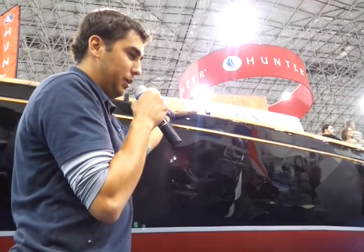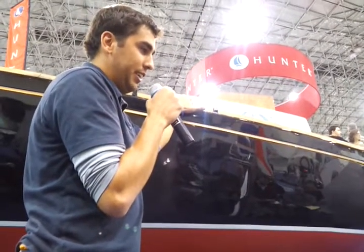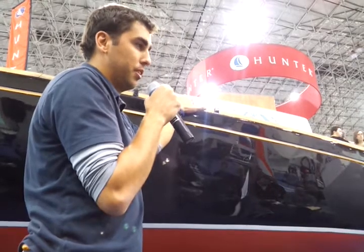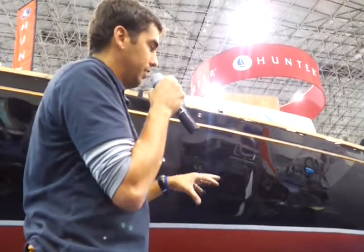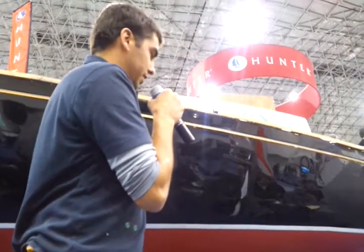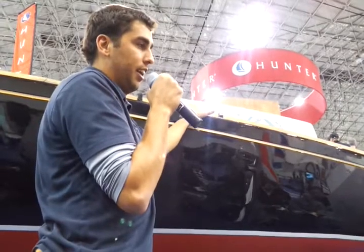And we just did a 46 Bertram this year. We started going at it, and we had to go after it with quadruple-O steel wool. It was the only thing, our buffers couldn't touch it. It just looked horrible. It looked like it was peeling in all sorts of places. The customer bought that poly prep, which is supposed to be able to strip it. We couldn't strip it with that. We couldn't strip it with acetone. We just could not get that off there.